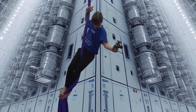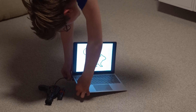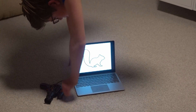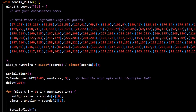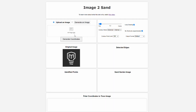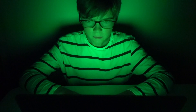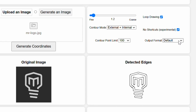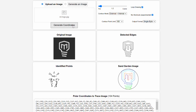So how are we going to do this? This would be a three-part hack. First, I download the image onto the laser tag gun. I stored the image as a sequence of points, because that's all the sand garden needs to recreate it. Luckily, I already did most of this in a previous video, so all I had to do was make a small tweak. I wanted to compress the coordinates to store each of them in a single byte, so that they could be more efficiently transmitted by the infrared beam.